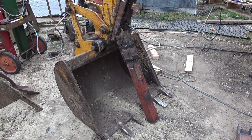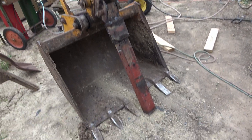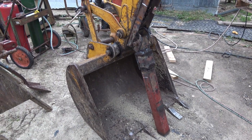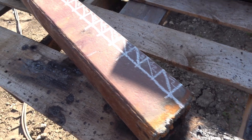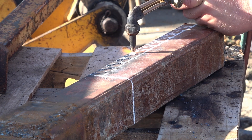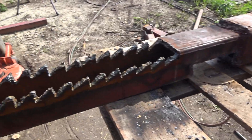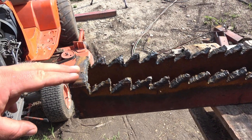That's actually looking pretty decent. You may have noticed the thumb did come back and hit the boom where it's rolled all the way back, but I'm probably going to be shortening that thumb an inch or two, so we shouldn't have too big of an issue once it's completely finished. And as you may notice, it's starting to rain, so I've got to get busy. Three days later — I got all the teeth cut out here on my main centerpiece of the thumb. I still need to trim the end once I get it measured and figure out what I need to cut at.